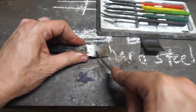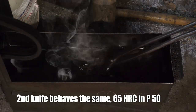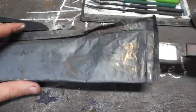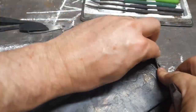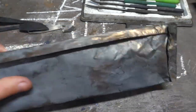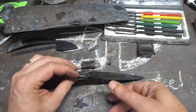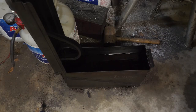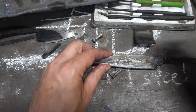Why is my knife so much lower on the HRC scale? Why didn't I check all this before starting my project? I've hardness checked the edge of my knife again — it's right about 56 to 57, and 58 would be generous. Let's run it back through heat treating, quench it again in Parks 50, and see if we can get it as hard as those two original knives. First, let's pop it in the oven for some normalization. A 65 HRC file is going to dig in everywhere, a 60 HRC file is going to pretty much dig in most places, and a 55 HRC file skates everywhere.